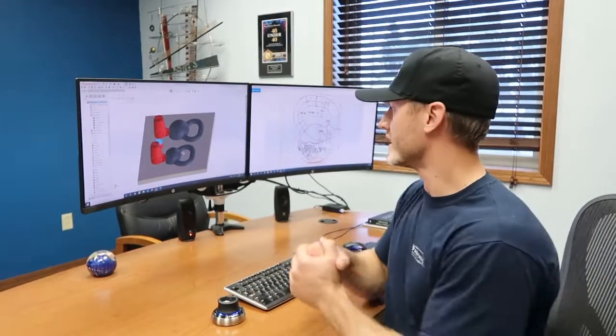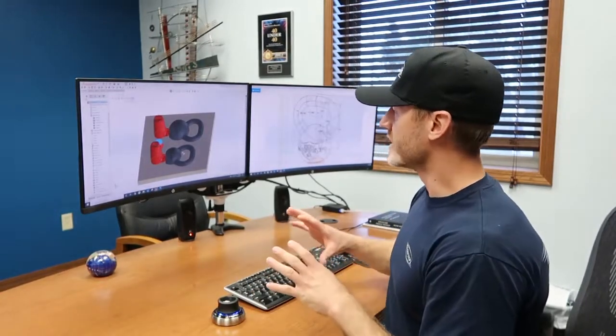So that's how a kettlebell is designed and made — from sketching the dimensions into a 3D CAD model, designing the tooling, CNC machining all the tooling so it's perfectly accurate, running it in the foundry, making the sand molds, pouring the iron, cleaning the castings, getting them powder coated, shipping them off to you — and you just get them swinging. Have a good one!